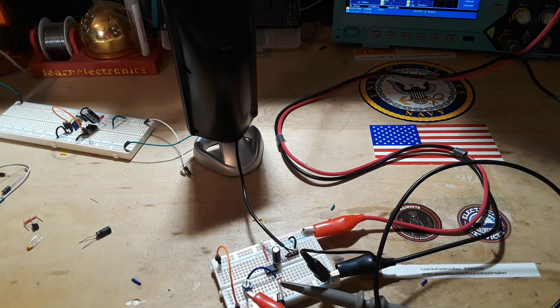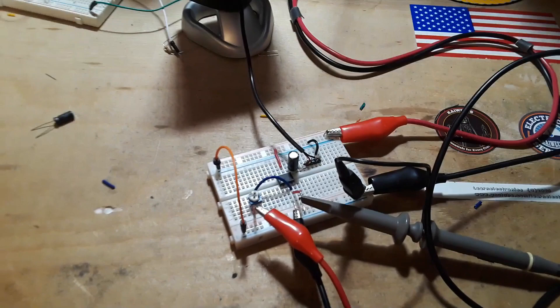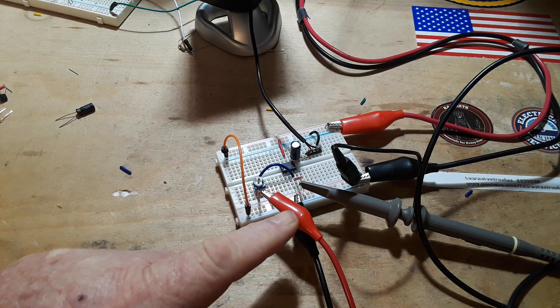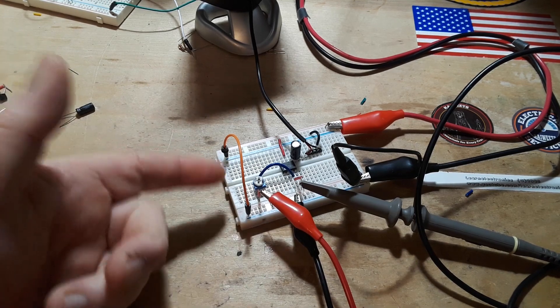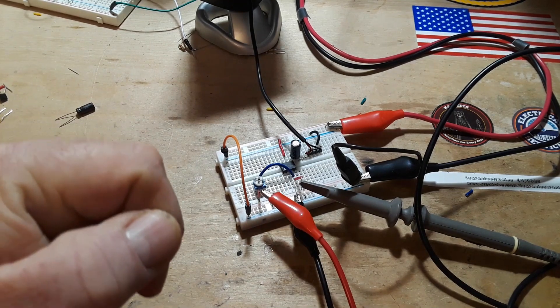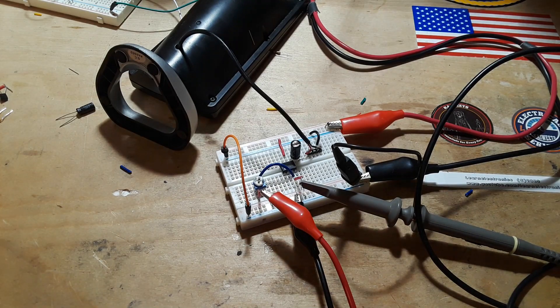I'm having some issues with this — what's new, right? For right now I've eliminated the frequency-dependent part of the circuit because it wasn't helping or hurting me at the moment. So here is the issue. The input is coming in from the signal generator — I have it on 1.2 kilohertz — and the other side of that potentiometer goes to ground as basically a volume control, bleeding off some of the input. What we're taking goes over to pin 3, there's our decoupling cap, and that's all there is to it.